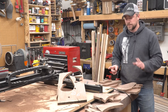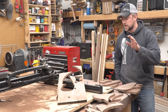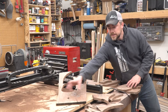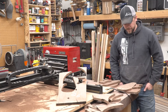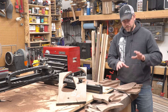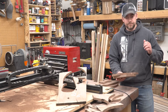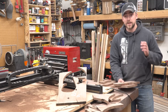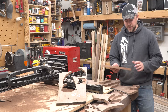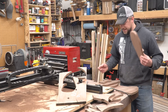The things we learned in this are: first of all, look at the giant mess I made. I had to pick up all these pieces off the ground and from under the workbench, just slinging them off the bandsaw. The CNC machine leaves a much tidier firewood pile — lots of leftover chunks I can use for other things, maybe pen turning, maybe whatever. The other big thing of note is that when it came time to separating my hand-cut ones from the blanks, the double-sided tape held much harder than I expected. And I ended up cutting myself on a sharp edge of the wood just trying to separate them.